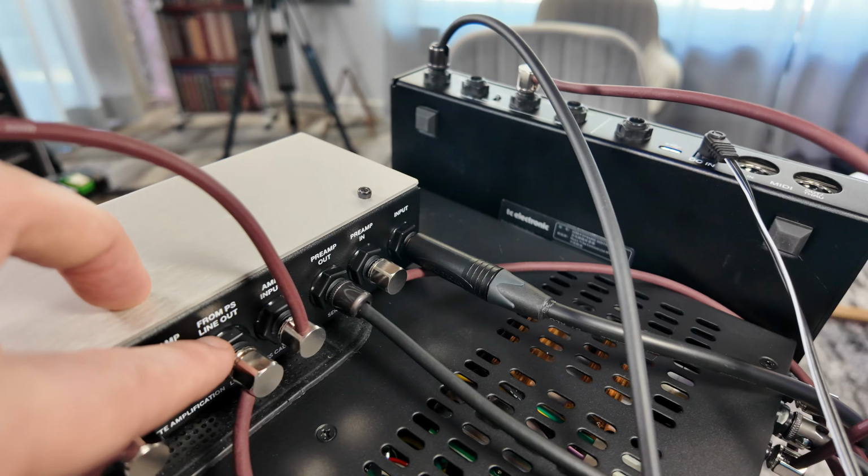Kinda neat. And you heard delay from this TC Electronic 2290p, because that's in the effects loop of the power station. Now you can crank your non-master volume amp, get it to sound perfect, and put effects behind it in the power station, which then amplifies that signal, that line signal, plus the effects in its own tube power amp into the cab. Nice. I also have a pentatone gate from Ibanez on there because it can reduce some noise post amp.